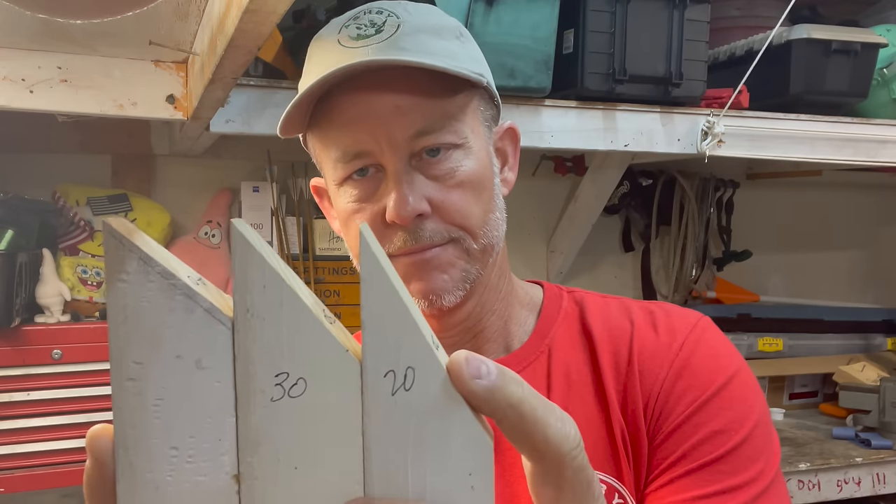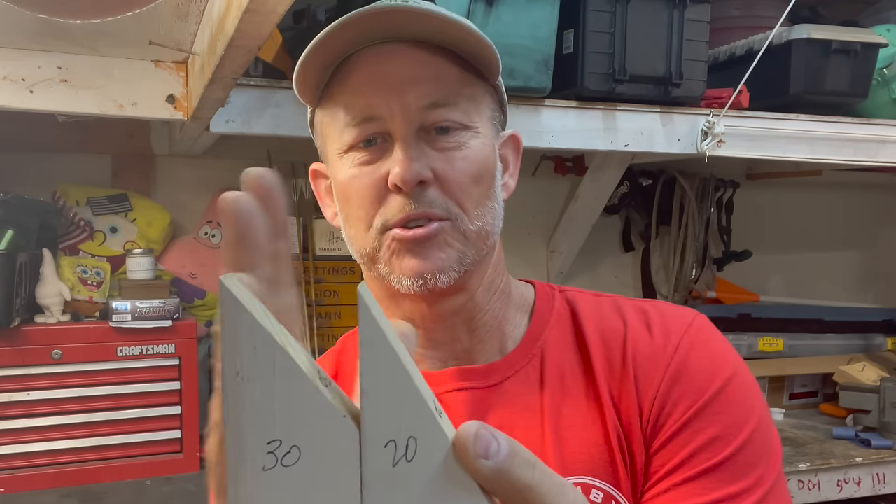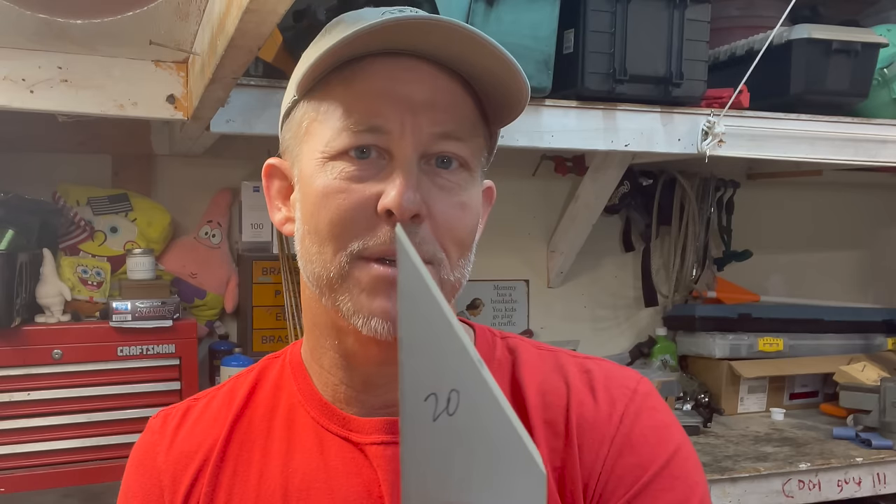You've got to have great steel to get to a very thin edge. Most broadheads are between 20 and 30 degrees. The steels hold up better more in the middle or towards 30 degrees, and you do want that. You could say you're going to make a broadhead with a 10-degree bevel — sure, it would be sharp, but the steel probably can't hold up because the cutting edge would get so thin it would roll over and compromise the whole edge. It's a balancing act; the broadhead's edge has to retain its sharpness no matter what it hits.